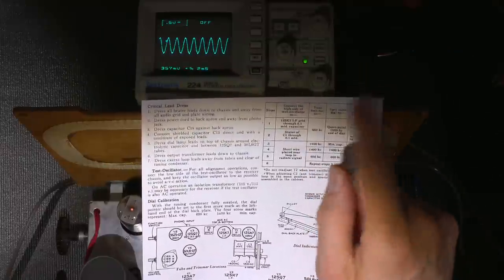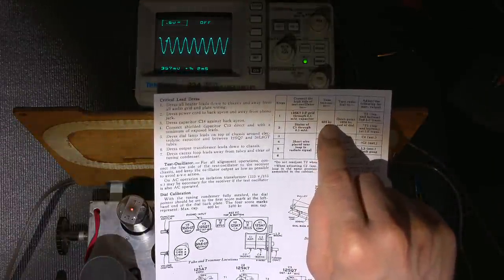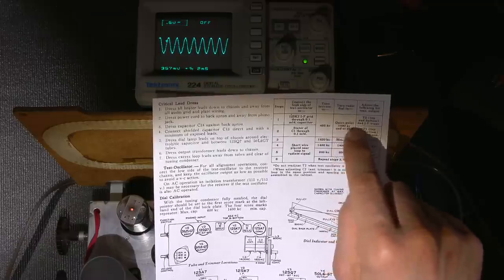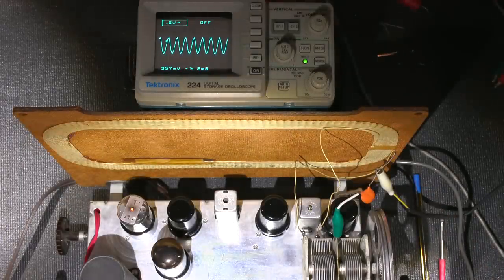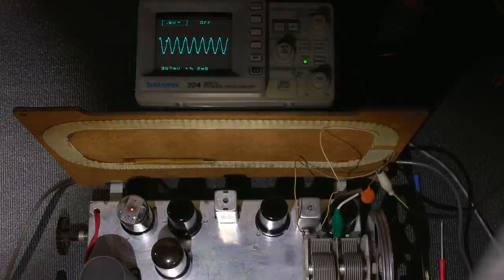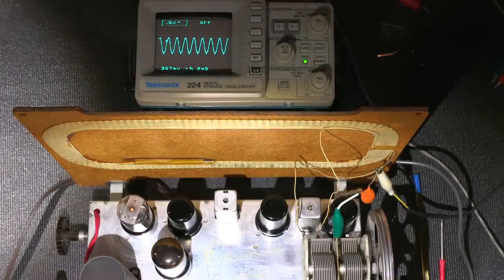The signal, or the frequency, that's being pushed through the IF section here is 455 kc's, or 455 kHz. The dial is tuned to 1600 kc end of the dial, or to a quiet spot. You can't see that, that's out of shot, but the needle is all the way over to this side here. The oscilloscope is attached directly across the speaker leads, and I'm looking at the tone from the signal generator right now. If I had that speaker hooked up, you would hear a continual tone, a 400 cycle tone, which would get a little bit annoying after a while.